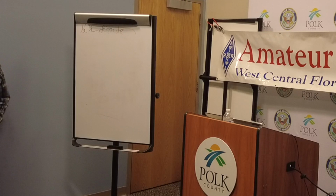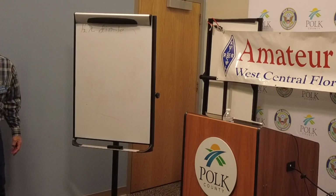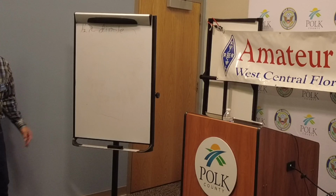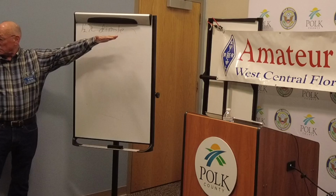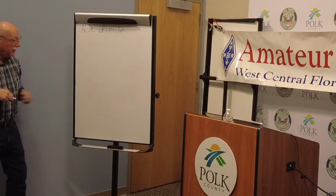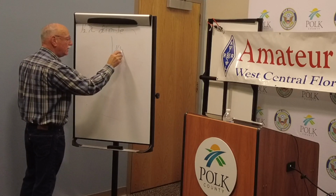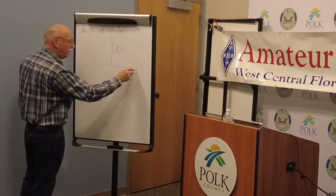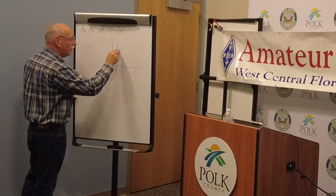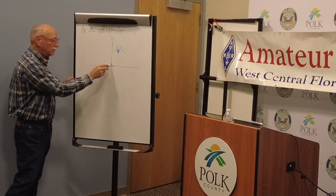Okay, let me cover one thing before we get there. I'm not sure I'm going to have your total answer, but we can find it. We talked about the straight dipole, 70 some ohms. Quarter wave, not half wave, quarter wave. What's the input impedance here of that?